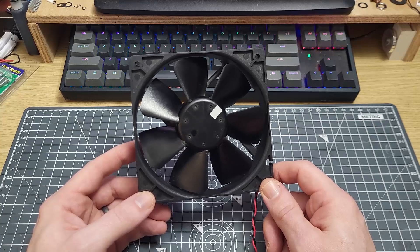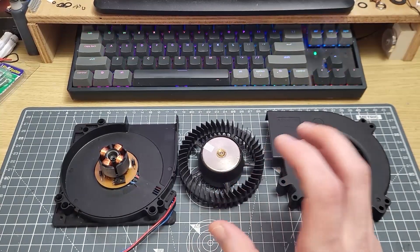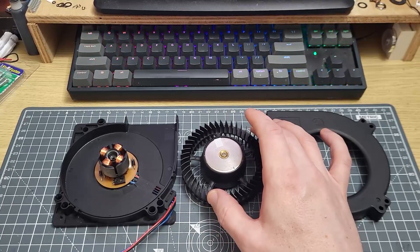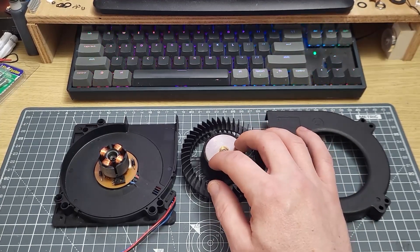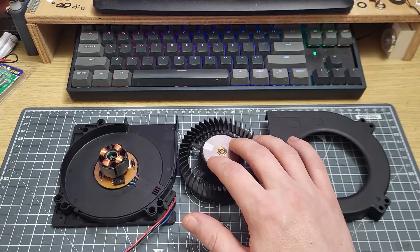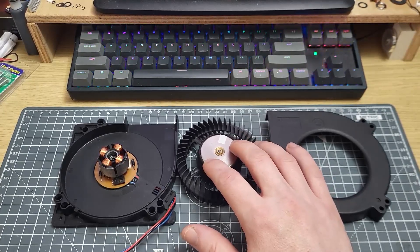Here's a quick explanation as to why the blower fan did what it did in the last video. The behaviour you saw is all to do with these two different forces and how the fans work. The blower fan works hardest when there is nothing blocking the outlet. That sounds counterintuitive, but that is exactly what's happening — the blower fan is working really hard to get all that air through that tiny little gap. As soon as that gap starts to close, the blower doesn't have to work so hard; it's not processing as much air, not developing as much airflow, but it is developing more pressure.